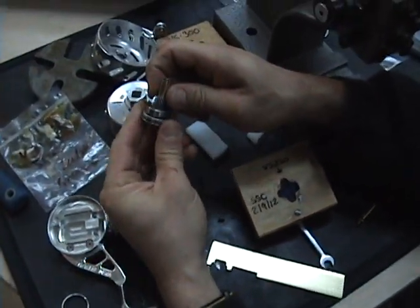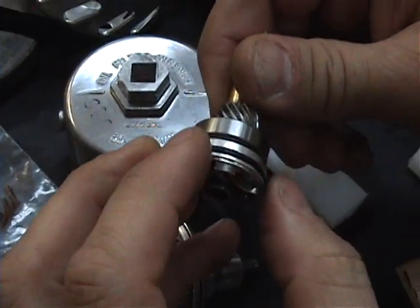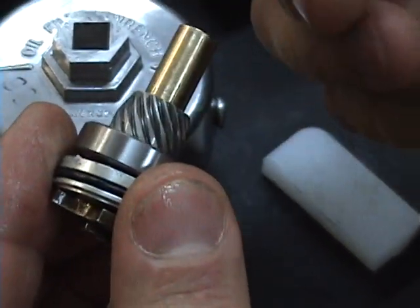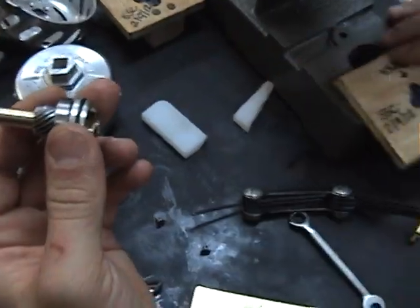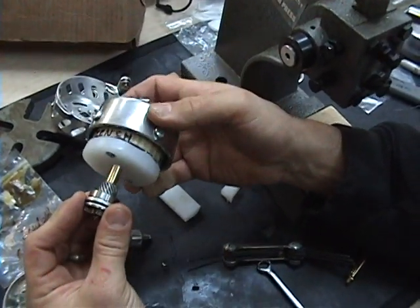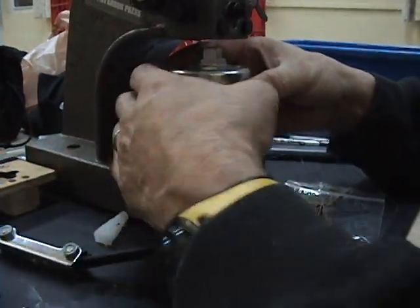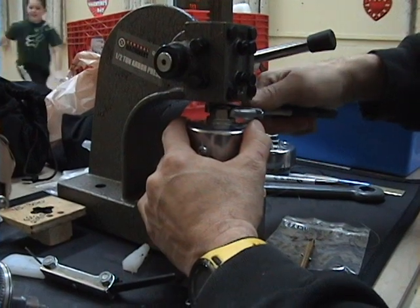What we have here is the gear, the bearing, and then the seal. In this seal piece there are two seals — there's the seal here and then the seal that stops water from getting on top. What we need to do is take off this threaded guide to get the bearing off. So the first thing we're going to do is make the press plate — put it in there. We're going to take this wrench that we created and fit it right in so the sleeve does not move. Then we get the adjustable wrench and adjust it to the size.